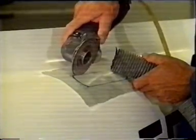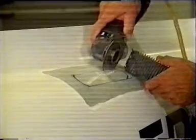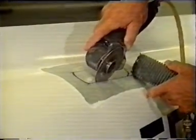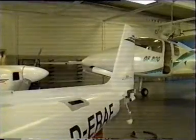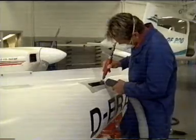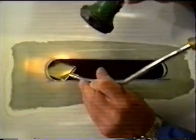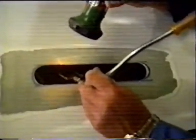The damaged section, also on a solid laminate, is generously cut out with a diamond saw. Once again, we use a rotary grinder for the precision work. When one of our top professionals does the job, it seldom takes longer than half an hour. For safety, the area around the cut surfaces is now inspected with a mirror for any hairline cracks.